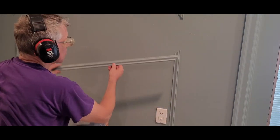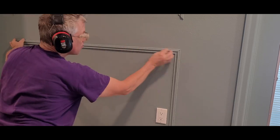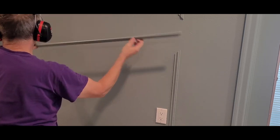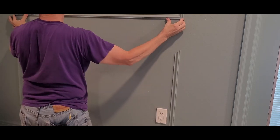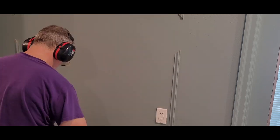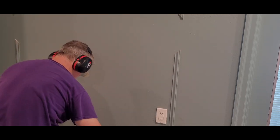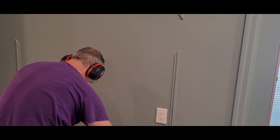Once I had the molding the correct length, I used that to check the fit for the other 3 rails for that section. Each one was cut and labeled and fit individually, just to make sure each joint was tight. Theoretically, all 4 pieces should be the same length, but theory and reality are really not the same thing. The 4 pieces were nearly identical, but off by just a bit. This ensures I get tight miters and visually straight frames.